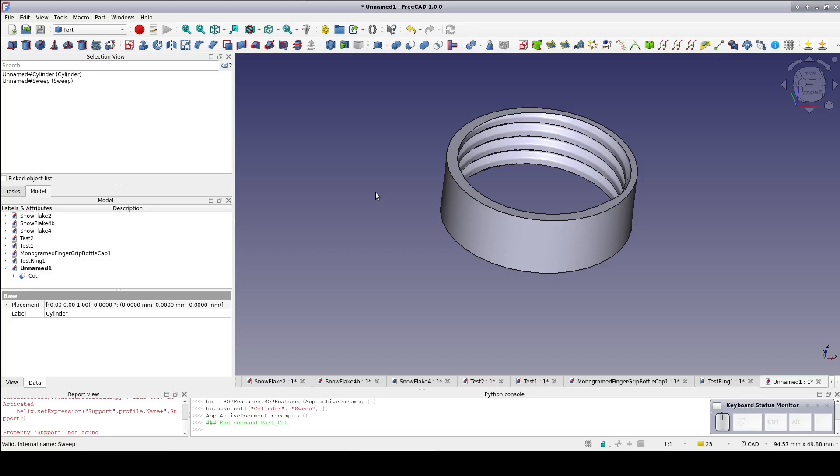In this case, adding the 1mm diameter tolerance was a really good guess. I get a tight fit, but not too tight. The test ring easily enough screws down onto the bottle threads until it hits the stop. As you're doing the test fitting, the minor diameter tolerance is important, but getting the pitch right is even more so. If you find that your test ring starts out screwing on just fine and then becomes impossible, the pitch is most likely wrong. On the other hand, if it screws on with difficulty the first time and gets easier each time you take the ring off and put it back on, you likely have an issue with sag during printing or little boogers of plastic forming on the threads. That may or may not be something you need to correct — it's perfectly acceptable if you just screw it and unscrew it a few times to run it in after printing.